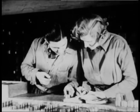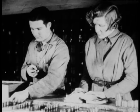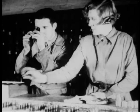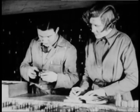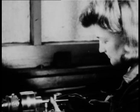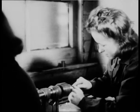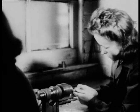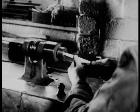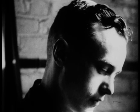The dies, after wear, have to come out of the machines and go to the die grinding shop, where they're examined, opened out and recut to shape, and polished again, ready for use in the wire mill. At the bench, they are re-ground. A girl polishes them to the necessary finish with willow wood, coated at the tip with very fine diamond dust, rouge and other materials. This gives the die its high mirror finish.